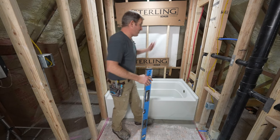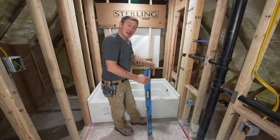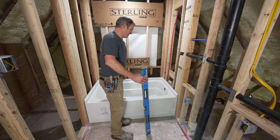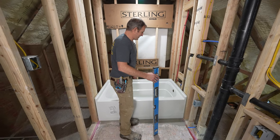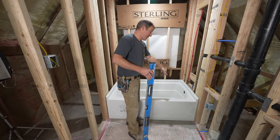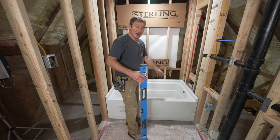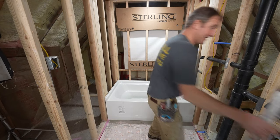I don't have my faucet in yet, so it's a lot easier dry fitting and setting your tub without having the faucet in — especially without the tub spout. You can do that afterwards much more easily. Also make sure you center everything up with your drain assembly to make everything look uniform. We're going to pull this out and put the tub drain assembly together first. That's going to make it a lot easier for a DIYer, because if you don't have a second person, it can be very difficult to put the drain assembly in by yourself.